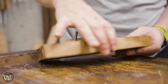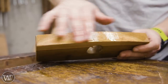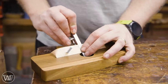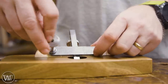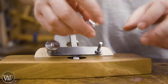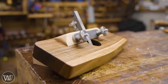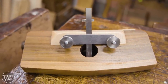We're going to coat this thing in boiled linseed oil. Paul uses shellac on his — he loves working with shellac and it really brings out a good finish on there. I would actually prefer it to be a little bit more matte, so I like to do boiled linseed oil and paste wax: smother it in paste wax, let it soak up as much as it wants, then wipe it off and polish off the excess paste wax and you're good to go. Put it all together and there you go — we have a router plane. Paul's design actually had two knobs to go on it. I generally don't like working with knobs, but maybe I'll put them on in the future.